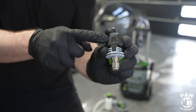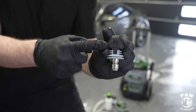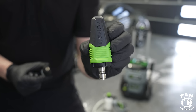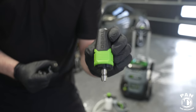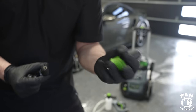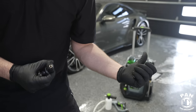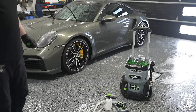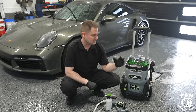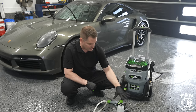Nice grommets on top let you store nozzles on the unit. The rinse nozzle provides little to no pressure — basically like using the gun without any tip. The zero-degree turbo nozzle gives 920 PSI on turbo mode — do not use on cars or wooden surfaces. Also, never use hot water or water from pools or lakes; warm water is okay. Once primed with the siphon hose, you still get good results.